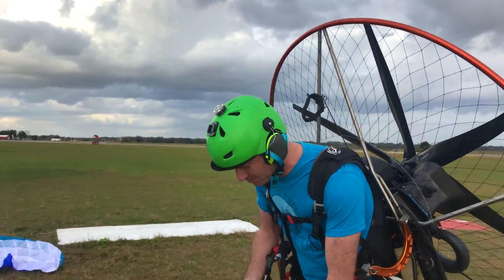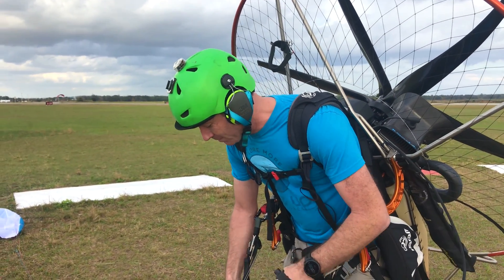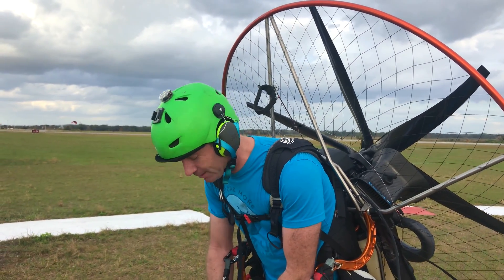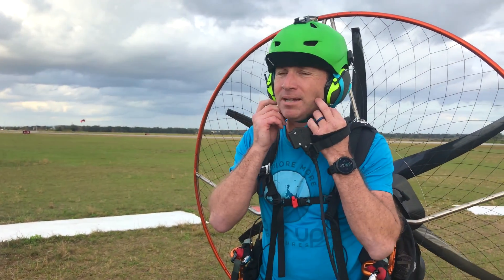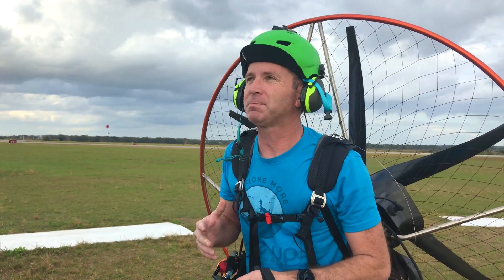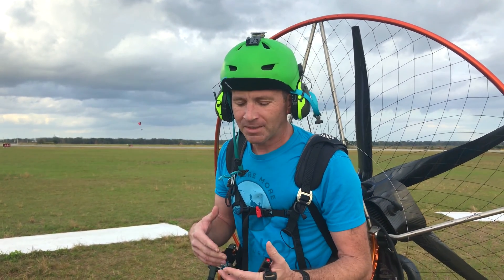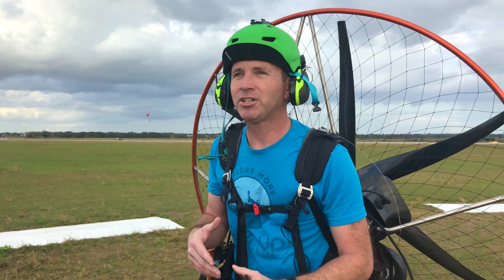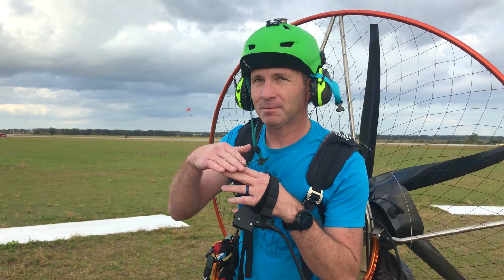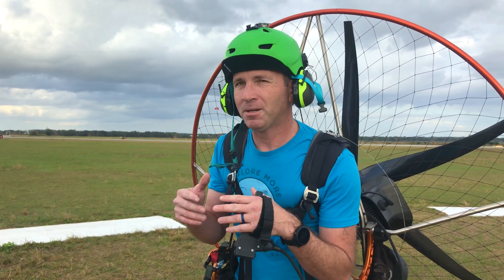It's super smooth and quiet, there's no question about that. The power is there, the three blade has it, but it seems like it's less power — though I'm not sure if that's because it's so smooth and the engine spool-up is definitely slower. What I want to do is check the RPMs, because it feels like the engine's not coming up to its normal RPMs. We've got to get an RPM meter on it and check.